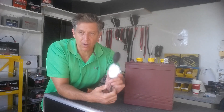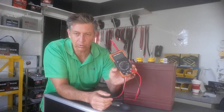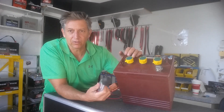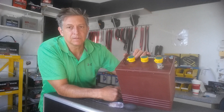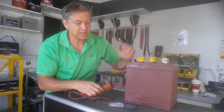Now if you have batteries that are mediocre, the hydrometer is going to tell you. Another tool you're going to want to have is an inexpensive DC volt meter. You don't need a real expensive one — just something that measures DC volts — and you want to measure the battery's voltage. I would first do this before using specific gravity, just to see if the hydrometer and the voltmeter line up. You measure the battery's volts on the lead terminals. You never measure the voltage on the stainless steel. Between these two tools, you start getting an idea of where your batteries are at.